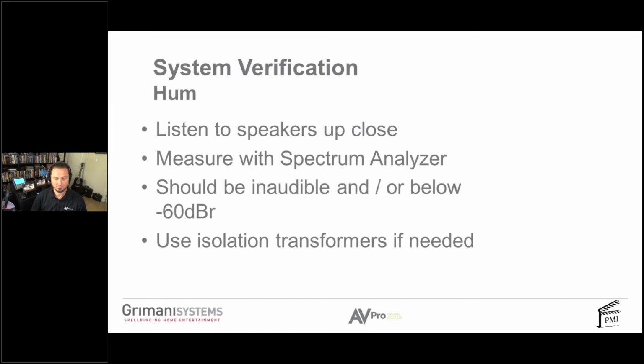Right. So now that you found out that lifting the ground on that subwoofer helps, now you've got to figure out where the actual ground connection is bad. It may just be that where you're plugging in that subwoofer, either the neutral or the ground is at a completely different voltage from everything else in the system. And the solution there, if you're serious about it, is to go fix it. So now you've got to play electrician and see what's going on in the panel, where the neutral is wrong, or run a long extension cord to that subwoofer from what's feeding the rest of your system, which could be ugly, but maybe that's what you've got to do.